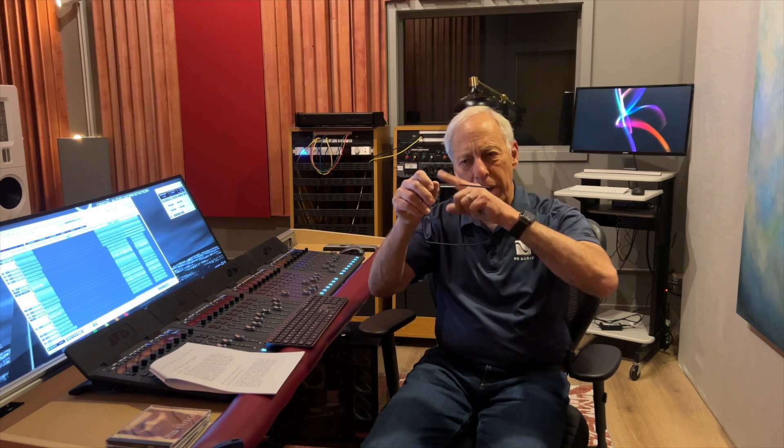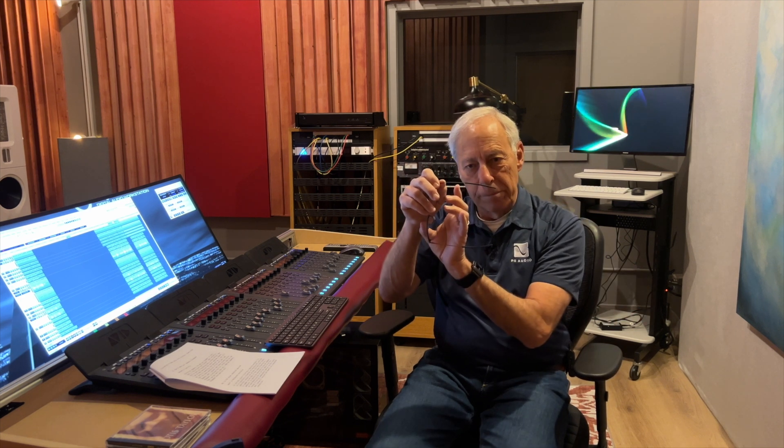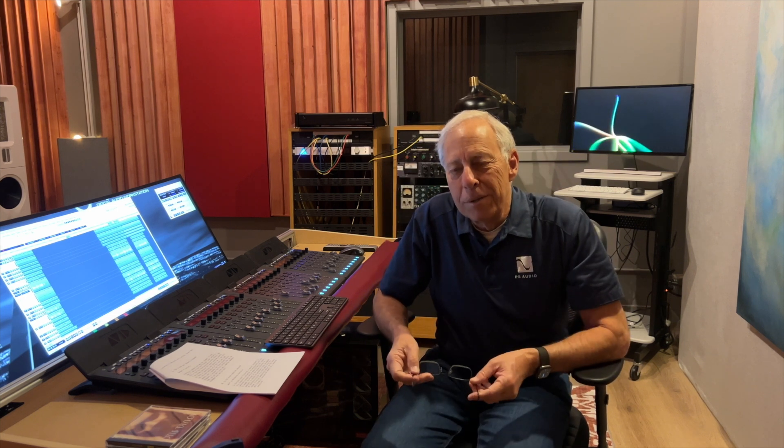We can do it electronically too, which is what we do here. But the signal — one's going up, one's going down — we have a difference between the two. This generates a magnetic field and we get a signal that ignores everything in common. That's how a transformer works. So what you need is an input transformer, and you can buy those online. For the highest-end applications, get a really good transformer — Jensen is probably the best out there. A Jensen transformer isn't cheap, but if you do it, you'll be glad you did. Thanks for the question.